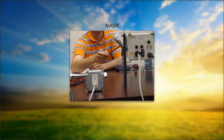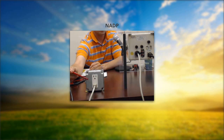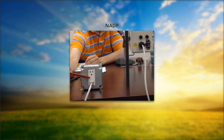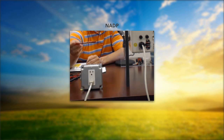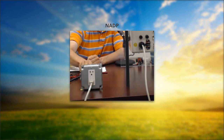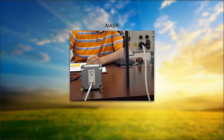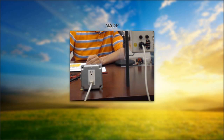That told me the problem was resetting my AC power — I had tripped the GFCI outlet. There's a test and a reset button, and the outlet had been tripped. Some newer outlets have a small light to show they're operating. We could see the clutch spinning, which confirmed the collector was now operating. We had tripped the GFCI outlet — this is a common problem we see at sites. Code requires GFCI outlets in most every location, but they can be problematic.